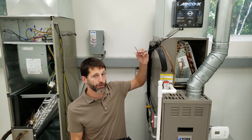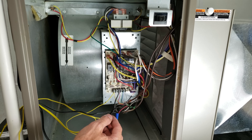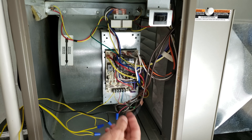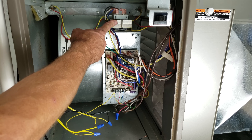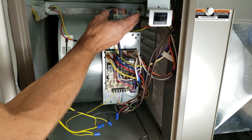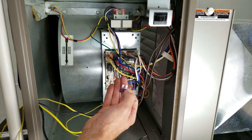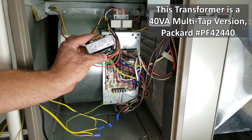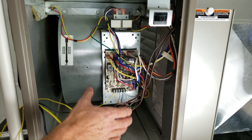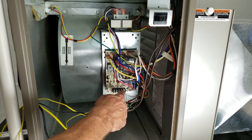For the 24-volt model, we have our 24-volt wire and we're going to take our power from the lower portion of the gas furnace electrical compartment. We attach the two wires to R and C in order to get our 24-volt power. Something important to consider: look at your existing transformer. If it's a 25 VA or 30 VA it has less headroom; a 40 VA can handle more current. There is also a 3-amp fuse. You just don't want to overload the transformer. If you have multiple accessories or two UV lamps, install an additional transformer to supply the 24 volts. The extra wires visible here are condensate safety switches breaking the Y wire to the outdoor unit — you can ignore those. Attach one wire to the R terminal and one to the C terminal.